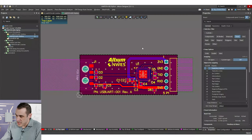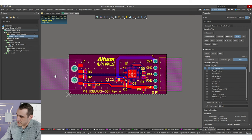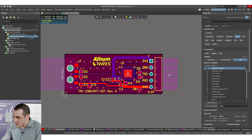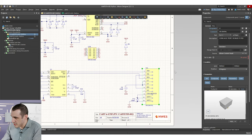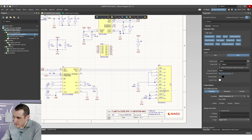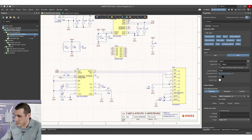So we're starting with our USB to UART converter from another project. Over on the left we have our USB connector, on the right we have our pin header used to access the TX and RX lines on the UART interface, and it puts out a couple of voltages. I've modified the schematics to include a line driver, which connects to a standard RJ45 connector, and that RJ45 connector will connect to the Ethernet cable going to the switch. On the switch side we'll have the same circuit to receive the data and send it back to the UART pins on the switch controller.